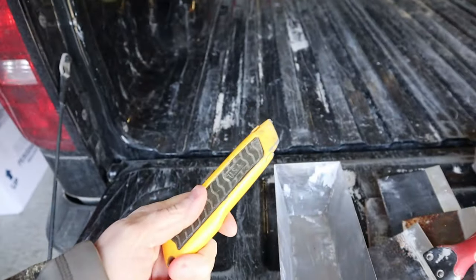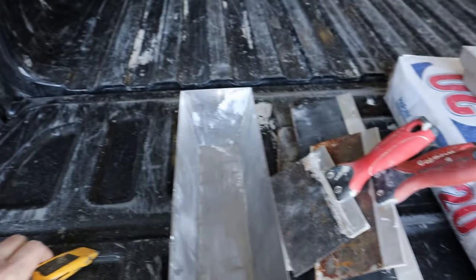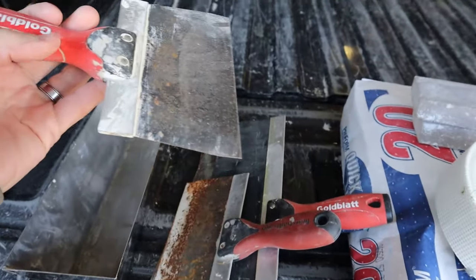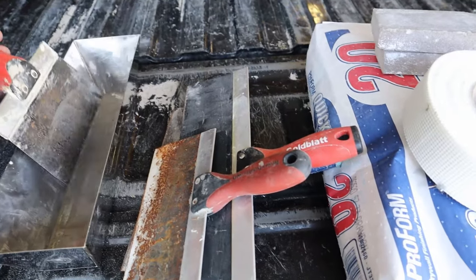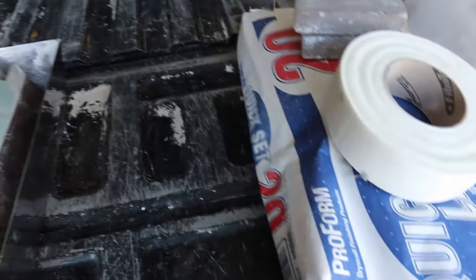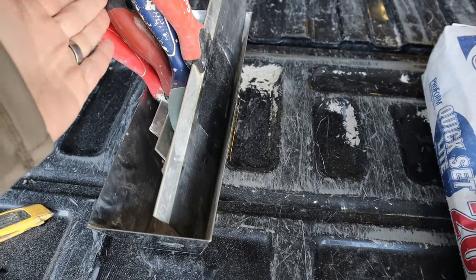Real simple tools. This is a razor knife — just a simple sharp blade. You're going to need a 12-, 14-, or 16-inch mud pan for mixing and distributing your drywall mud. You're going to need a graduated series of blades: a 6-inch, 8-inch, 10-inch, and a 14-inch blade kit. We'll apply different coats of mud to the area with progressively wider blades — it helps taper it down.